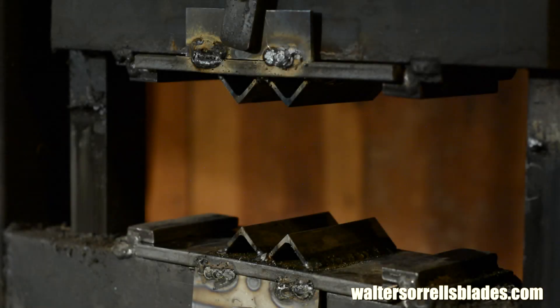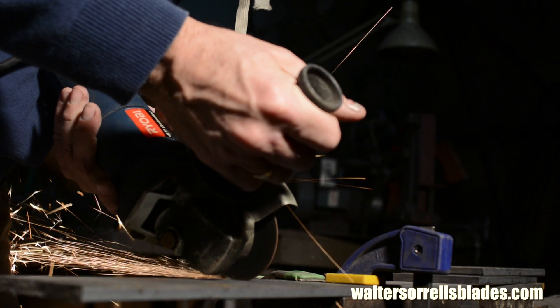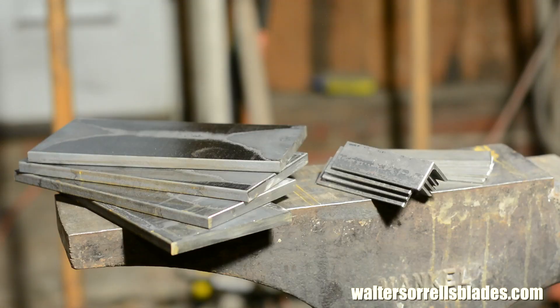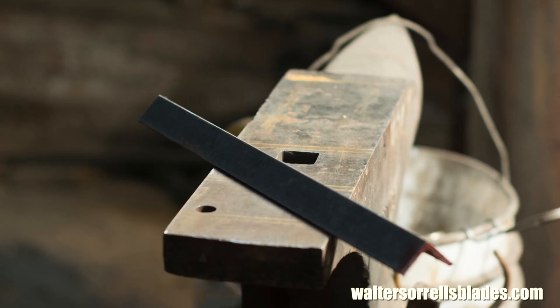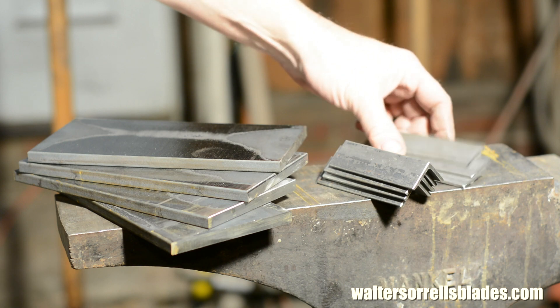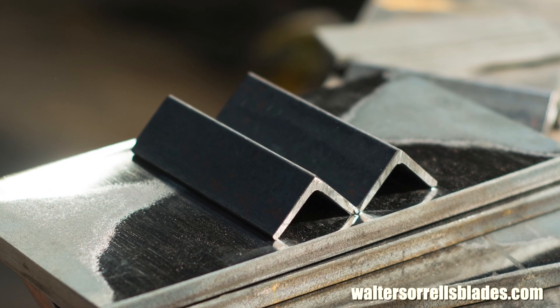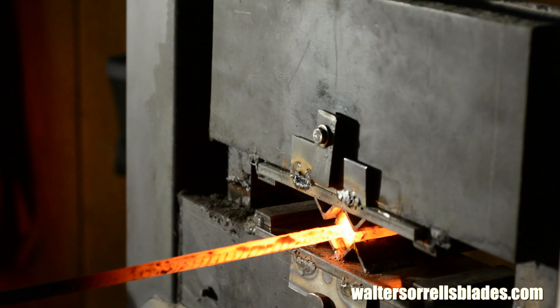The first die I'll show you is the simpler of the two. These will be one-inch squaring dies, meaning the die will be made to form square billets measuring one inch on each side. My forge press uses die plates that are three-eighths of an inch thick by four inches wide by eight inches long, so I'll use a cutting wheel in my angle grinder to cut the plates from a longer piece of stock. Next, I'll cut four pieces of one-inch angle iron — just standard stuff you can buy at Home Depot. I'll also use some one-by-one-eighth-inch stock for a retention plate. The basic idea is to use two pieces of angle iron on the top plate and two on the bottom, so that when the two dies are brought together they form a square. Dead simple.